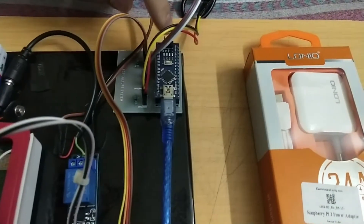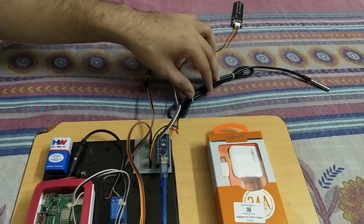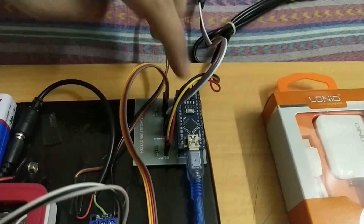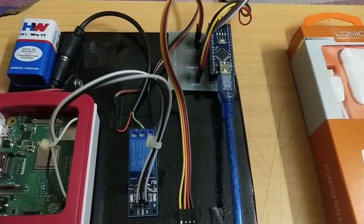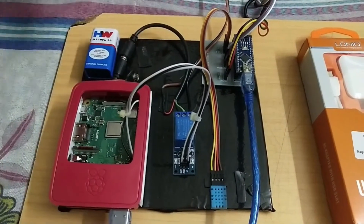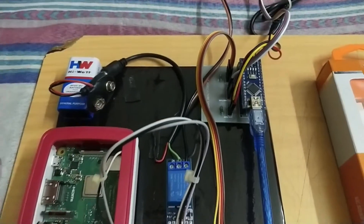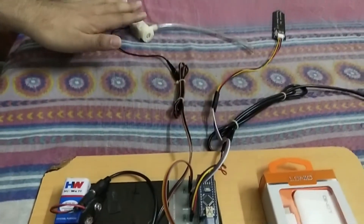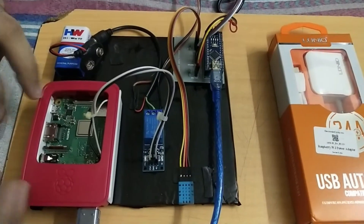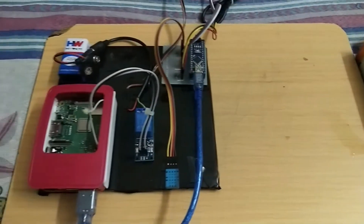This is the sensor control unit which uses an Arduino Nano. All the sensors — the DHT11 sensor, the soil temperature sensor, and the soil moisture sensor — are connected directly to the Arduino. The Arduino gets these values and serially transfers them to the Raspberry Pi, from which the values are sent to our server database. We've used a battery to represent an external power source for the pump, since in a real-world scenario this pump would require a much bigger supply.